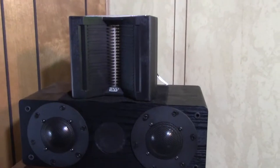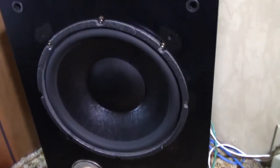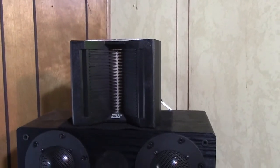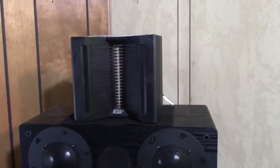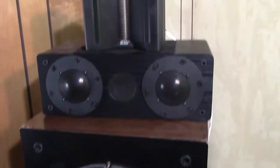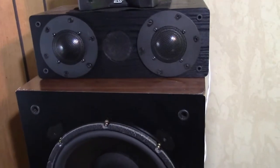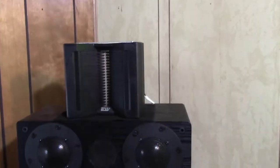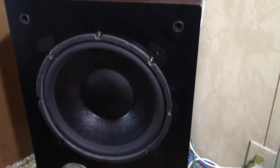The mid-range is handled here, and the highs are taken care of by the Heil Air Motion Transformer. Each one has its own amplifier: the bass driver is driven by the Behringer EP4000, the mid-range is driven by the Carver M400T, and the Heil Air Motions are driven by the Carver 0.5T. They all get distributed through the Ashley XR1001 electronic crossovers — I have two of them because I need two for tri-amp mode. I can move the mid-range back and forward for spatial enhancement and time alignment, and they all sound very good even running flat with no equalization.